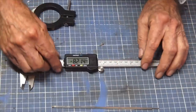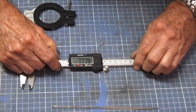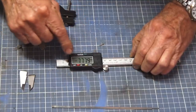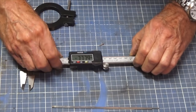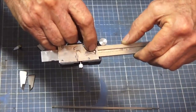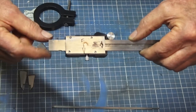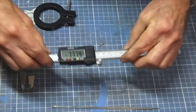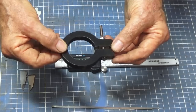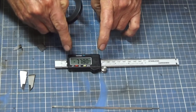Of course we also have to anchor the sliding section of the caliper, and on the back of that sliding section I've drilled a single hole — that's going to be the mounting point that attaches to the top of the tailstock body. That fixed point will screw down to the casting, and the end of the caliper will slide in and out with the tailstock quill. I'm going to cut the bracket out of a piece of 10mm thick aluminium plate on the CNC milling machine.